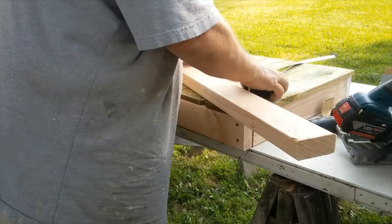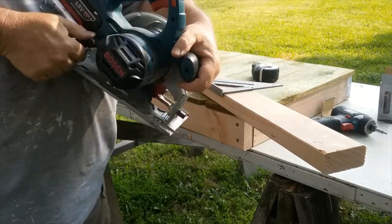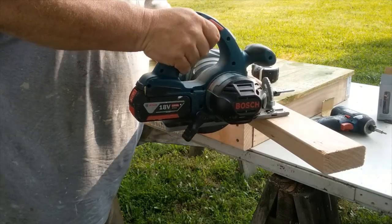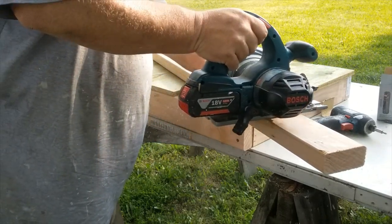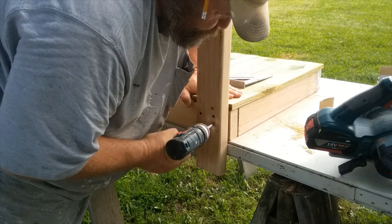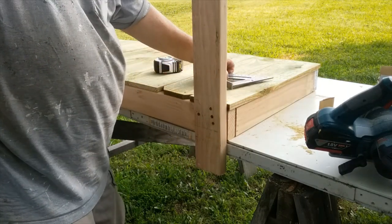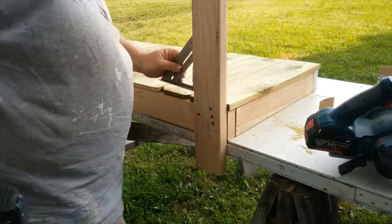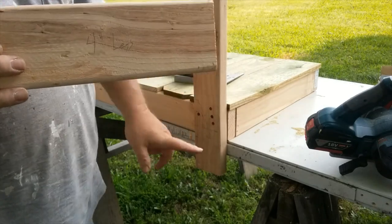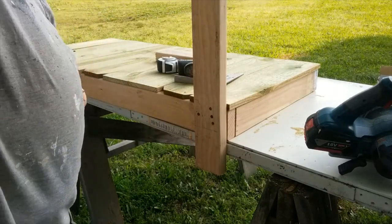Here I'm marking and cutting. I've already marked it. My legs are four inches below the bottom there, and they should be six inches — then the bottom ones are 32 inches all together. I've got it screwed in here using three-inch deck screws so I can go all the way into that other 2x4. With the weight on it, three or four screws is all you need. There on the side you have the four inches hanging down.